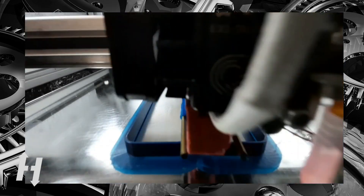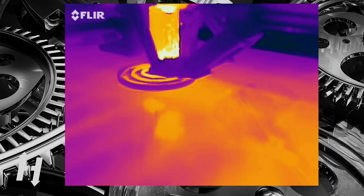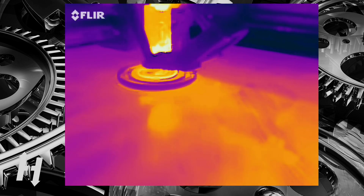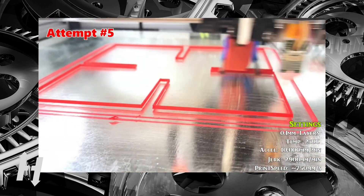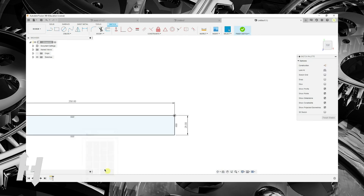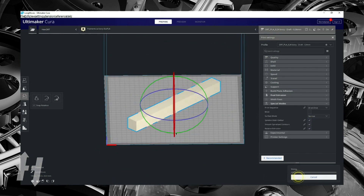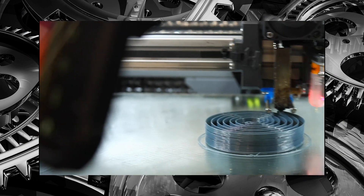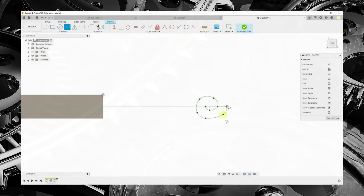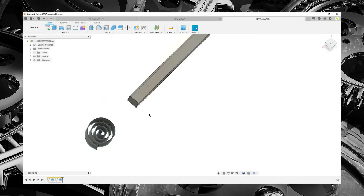Today in this video, I will compare the cooling performance of three cooling systems using a FLIR infrared camera. No precise readings will be made, but this method should give us a good understanding of what is happening when printing with these three systems, or a combination of two of them. The print head of the Evort can move quite rapidly, so the infrared test will include two types of parts. The first test will use a part with long moves, where the print head does not stay for a very long time in the same area — a 250 millimeter long box printed using spiralized mode from Cura, also known as vase mode. The second test will use a spiral-shaped part to maximize the time the print head spends over the same spot. I created an approximate spiral shape in Fusion 360 with a certain thickness, also sliced using spiralized mode — a spiralized spiral.